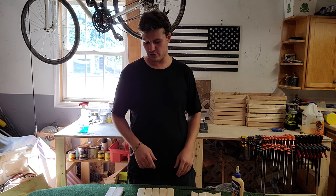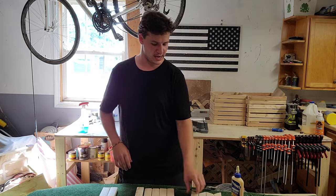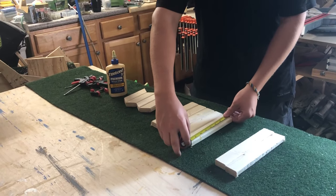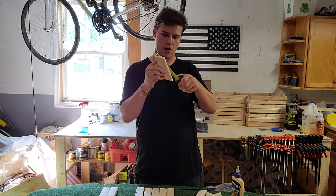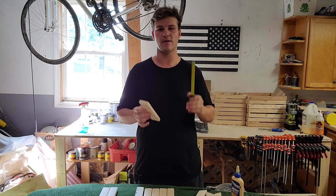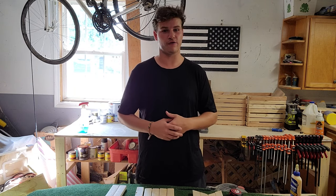You're going to cut down that one by two: two pieces to nine and a quarter inches, five pieces to eight inches, and then you're going to do these pieces with the angle — these are going to be the legs of the picnic table. From the top of the tip to the bottom of the tip they're about five and a half inches. They don't have to be perfectly five and a half inches, but you do want to make sure all four legs are the same. That's all you're going to need for wood.